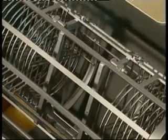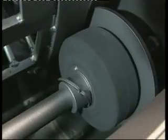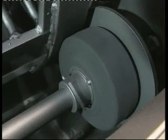The drum drive mechanism of the Aerota is on the front shaft and is supported by two sets of sealed bearings, which should be greased on a monthly basis with standard LM bearing grease.